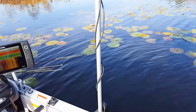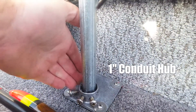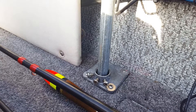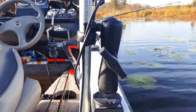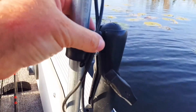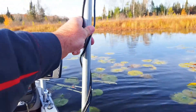The pole itself is three-quarter inch conduit that I bought at Farm and Fleet. The way it's held onto the boat is with a base that has a ring - I honestly don't even know what this piece is called. I found it at the hardware store and I believe it's for a one-inch conduit. I drilled a couple of holes so I can have some set screws to hold it in place. There's a piece of aluminum on the bottom so it doesn't dig into the carpeting, and up from that is the RAM mount arm - the kind you'd use to hold a trolling motor in place. It's got a one-and-a-half inch ball, and between being held tight at the base and up top, this is actually quite steady.